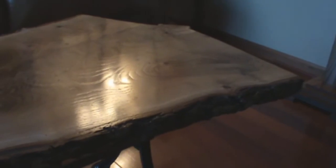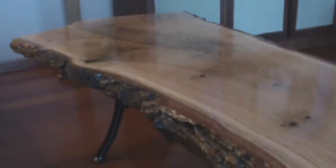I maintained the bark on the live edge, due in part to the fact that this slab was cut during the winter, therefore holding its bark a lot better. What I did was take a small chip brush and an acid brush and brushed the polyurethane in a number of coats into the bark itself, and that should seal it a little bit better. Let's see if I can get a better angle of the bark and how it came out. There, you can see it a little bit better.